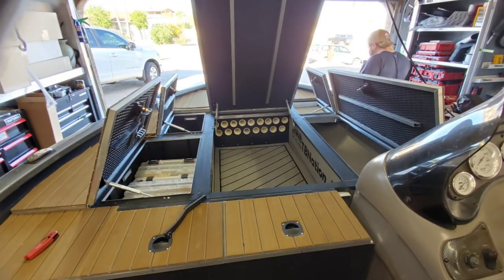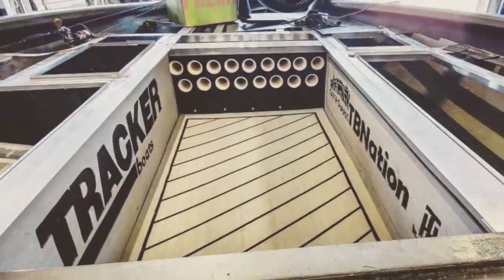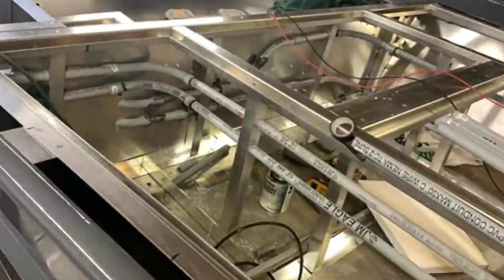Dry hatches — they should be right for you now. The bleed-out systems I've always done may not have been the easiest to understand, so I've cut this down in a very short, strict, and to-the-point video. I want to give you the easiest system — our Gen X framing, a full riveted version out of aluminum — to make a full water diversion system. I use both systems on my boat: the full bleed-out system throughout the core, and this water diversion lip throughout smaller compartments where there's not enough room for a bleed-out system. This diversion system still does a really good job and works in a more compressed format, letting you frame right around the hatches without losing a lot of space. We also sell full-on bleed-out systems through Nate on our site.